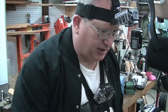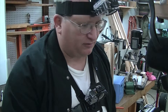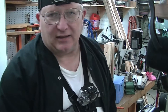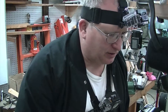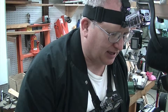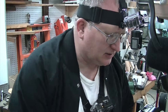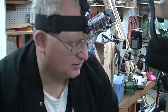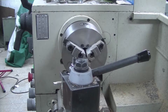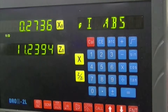Why 218? Well, although the outside of the bullet is 223 or 224 for 22 barrels, the inside on the groove — basically the minor diameter — is 219, and we want to have at least a thousandth clearance. So we'll cut her down. We should be at 273.6 right now. I'm not going to do anything that accurately — 273, okay, good.